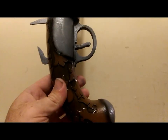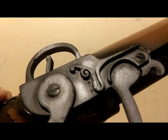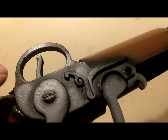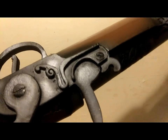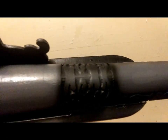Whenever I put the clear coat on the gunmetal part, it's going to look really, really nice, because it made that wood part just pop — that shine. I went in here, and I just sanded this with a Dremel to get it smooth, but I still wanted bumps in it. Same with down there — you can see down here that's actually intentional, because this cast iron was never the best, smoothest metal. These flintlocks never had the smoothest, best metal. You can find really good flintlocks now that have been remade, and they're super smooth with chrome and silver and gold. But the old antique ones, that cast iron had life to it, and it had textures and all this different stuff. So a lot of this stuff was intentional.